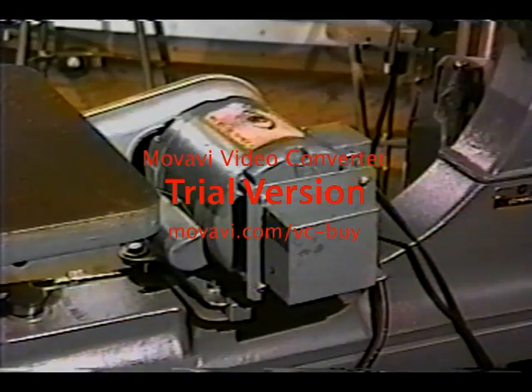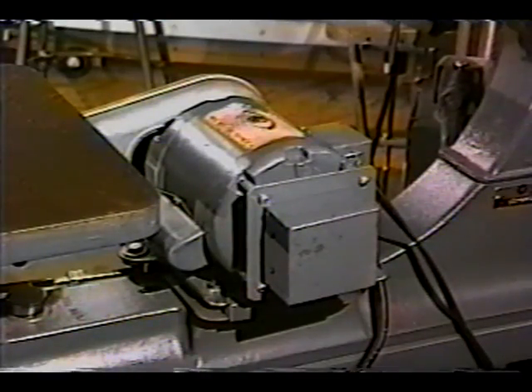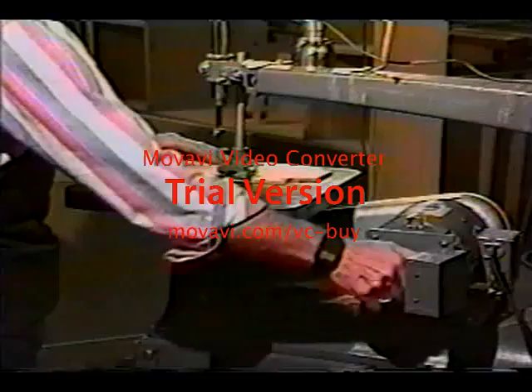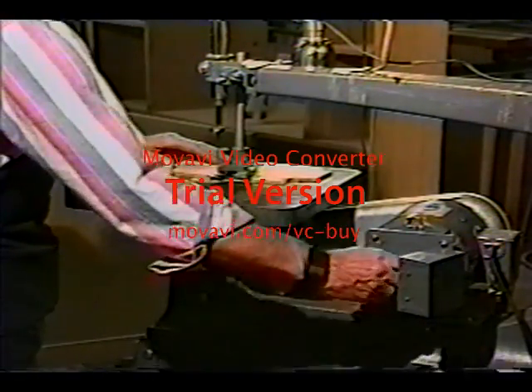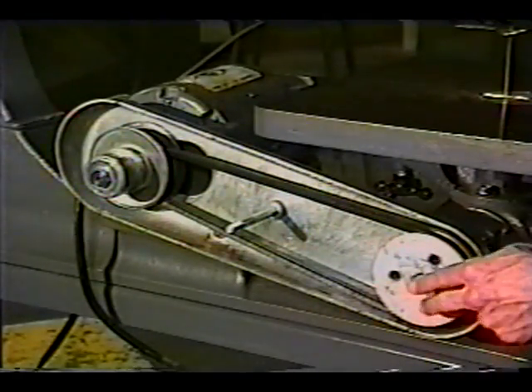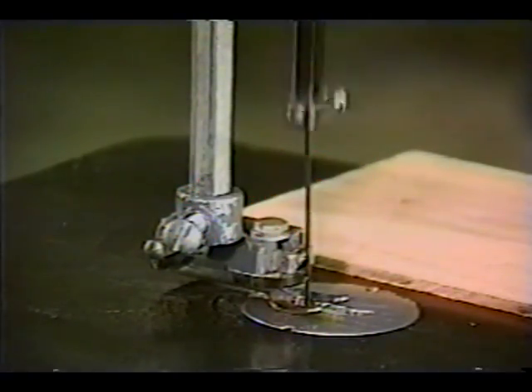The power of the scroll saw is determined by the size of the motor. Motors range from one to four amps. Most modern scroll saws have induction motors that are totally enclosed and protected from dust. Some saws with electronic speed controls utilize DC motors. Older conventional style scroll saws may have a general purpose motor that can be damaged by excessive dust accumulation. The cutting speed is sometimes adjustable from 400 to 2000 rpm, adjusted by moving the drive belt between step cone pulleys or by adjusting the electronic controls. Single speed saws run at about 1700 rpm. Be sure to check the operator's manual or the shop supervisor to determine the best speeds for each individual operation.